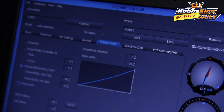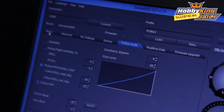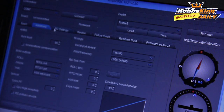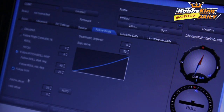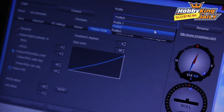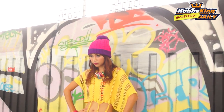I'll just show you a couple of screens. What's really nice is that it has different profiles selectable — you can do it through an RC channel or a switch for a handheld gimbal. The first screen is essentially just basic PIDs for tuning out vibrations — if it's shaking or hunting. There's a lot of information on the web about doing that. The advanced screen gives you some options on how you drive the motors.